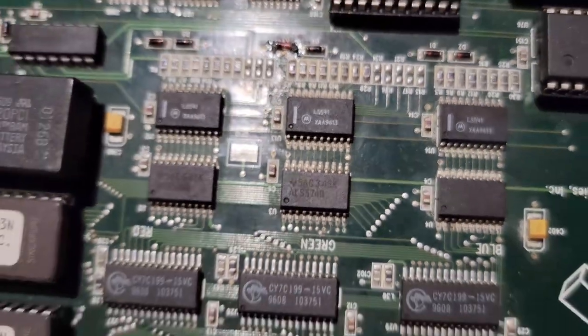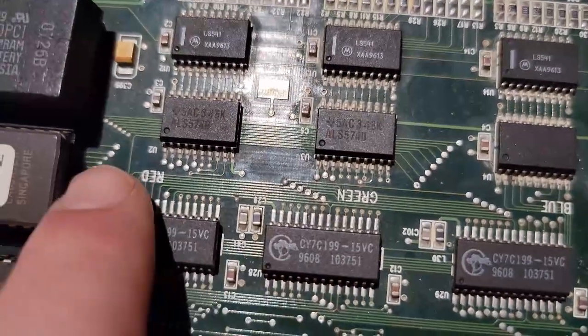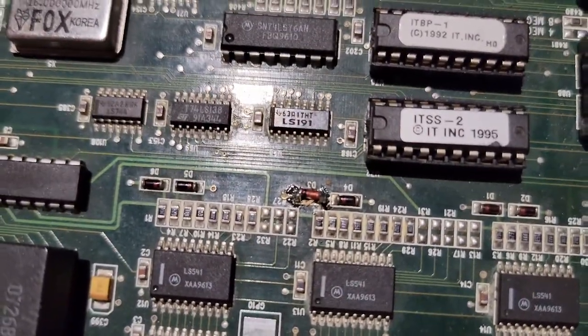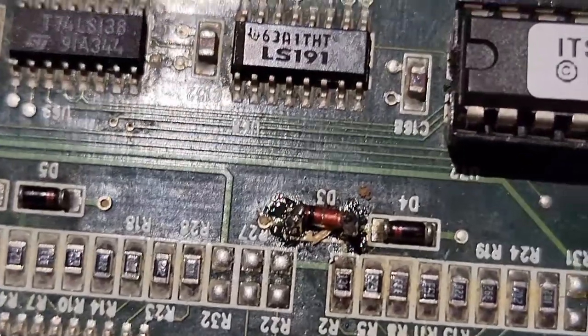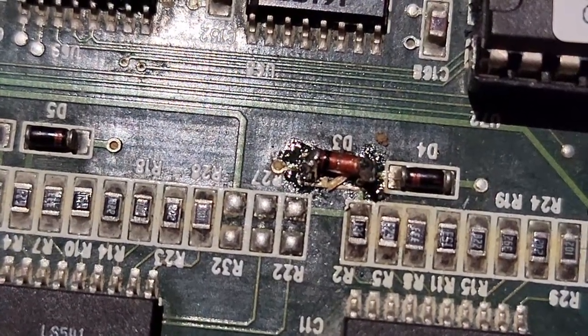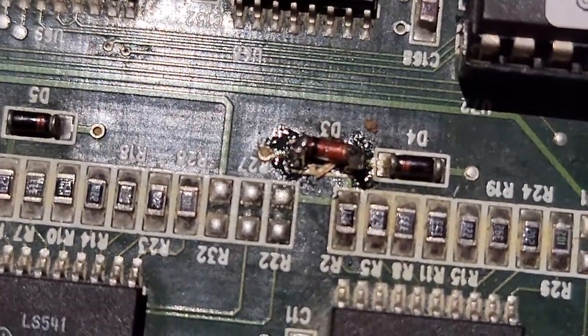In the video section, as you can see, red, green, blue — as it's marked. I already changed it out, and it's not a very good job. That diode was shorted, so it was just pumping green video signal onto the screen.